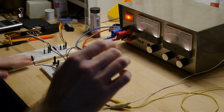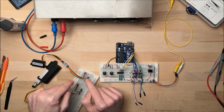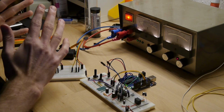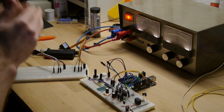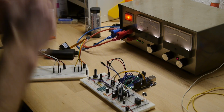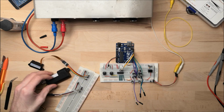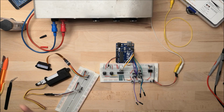We will now connect up our linear servos over here, but we will only connect up the power inputs. So it will be my job to regulate on these potentiometers when to stop the servos. So this will just be a very quick, very careful test, because if I do not switch off the voltage at the right time, we will literally run this thing straight into the ground. I will extend it too far or retract it too far, completely breaking the gears inside, and one of these is $80, so I really don't want to do that.